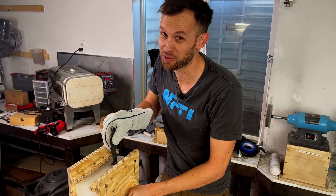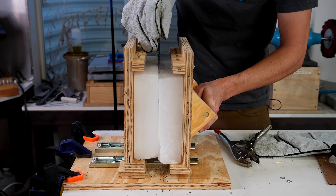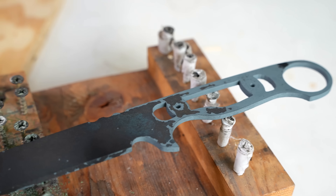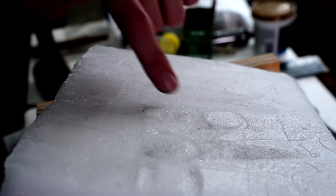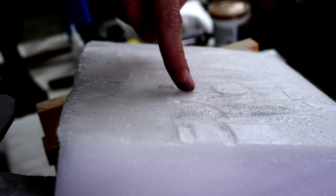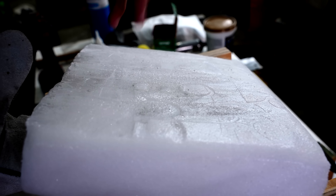That's a good sound. We have angered it. The knife has cooled down, and I am happy to report it is quite straight — at least as straight as it was when it went into the kiln. We're going to let it get to room temperature before we do a hardness test. You can see the impressions of the knife in the dry ice — there's the blade going down, and here's one from the handle. You can see the ring from the handle. That's why I was moving it, because I knew if I held it in one spot, it would just sublimate away the dry ice and I'd be getting that vapor jacket again.